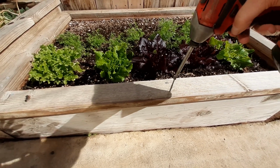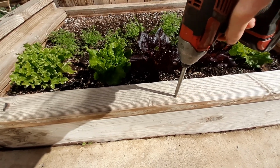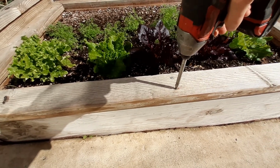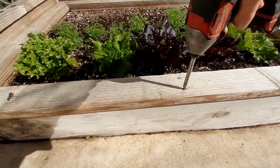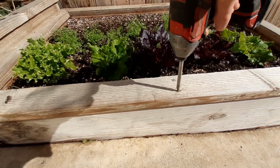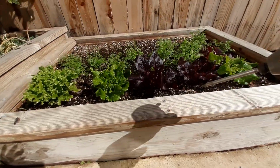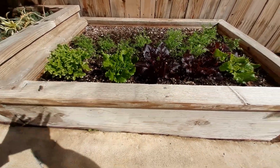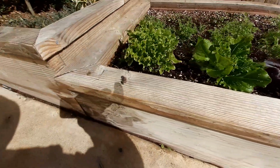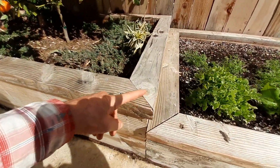Oops, this is just not the right head. What you want to do is push down at the last part to make sure it sucks down tight. The board will start pushing down. You can see it closes the gap. Don't sink the screws in. It looks pretty ugly if you sink the screws in too deep. The key is to try to get this flush on top.